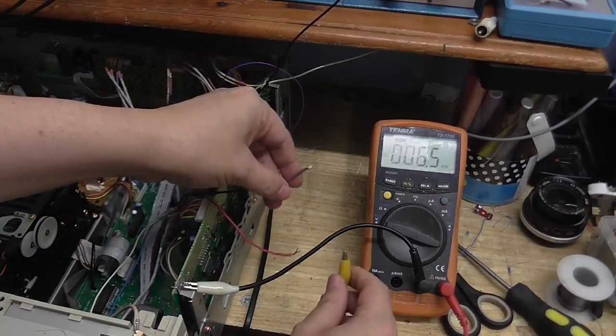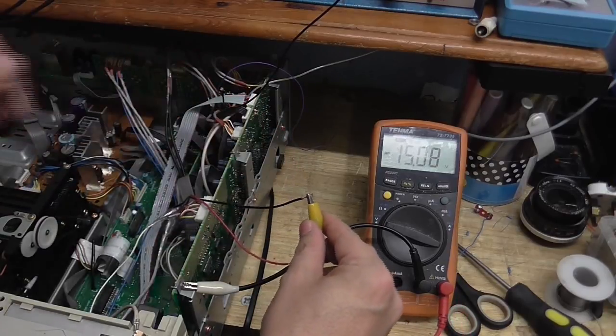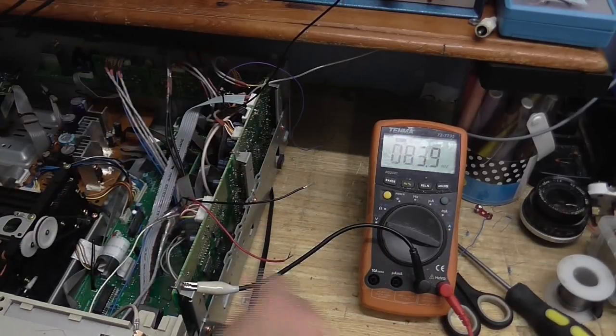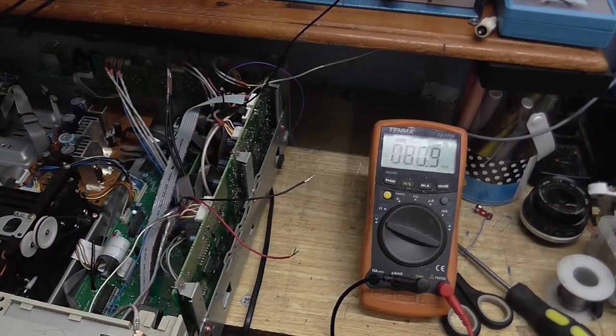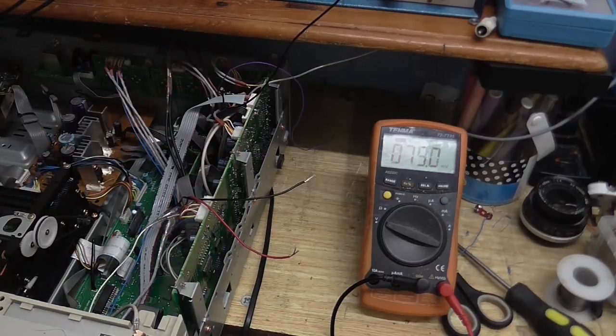Hope that wire's not going to short circuit on anything. Let's make sure we've got negative 15 volts here. And we do. Alright, so turn off again. Just making sure each of these wires are what I think they are, and they are, so we can connect the little active circuit up to the thing, and we'll have our non-balanced input.